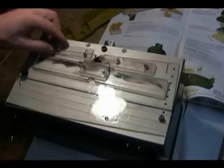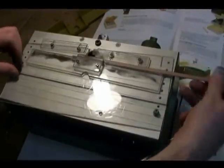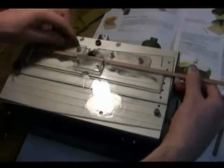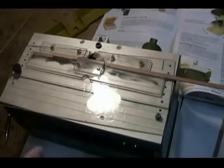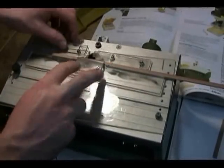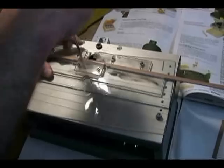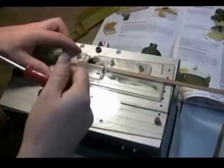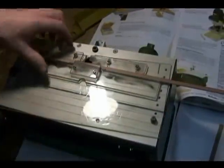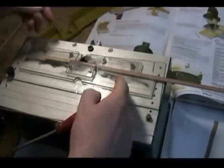Now, he's explained that when you run wood through this machine, it's crucial that the fit is tight and there is pressure coming from this direction and also downwards, so that the depth of cut is consistent along the length of the wood. So what he does is he puts it in, presses that tight, and then screws these screws in accordingly. I've cut my finger badly, so I'm having problems screwing that. And there's also another piece on this side to hold it straight.